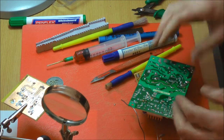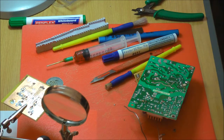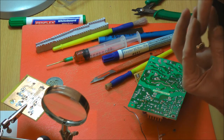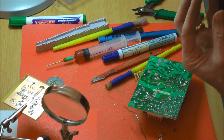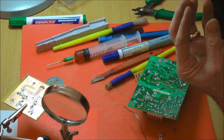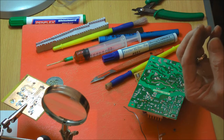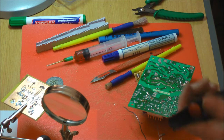That's the preferred technique with those with a hollow bit: when you heat it, you don't just draw, you waggle it, so you're pulling the component away from the hole, because if it's through-plated, the solder drips all the way down, and if it's a thick board, it can really hang in there. Sometimes you have to do multiple operations before you can clear the component. How much does one of those things cost?